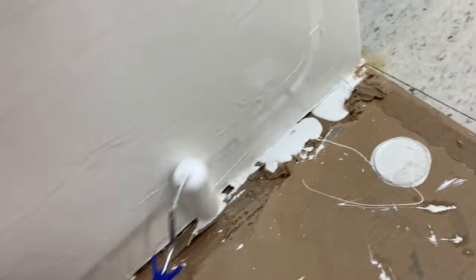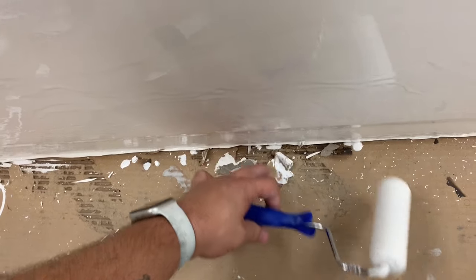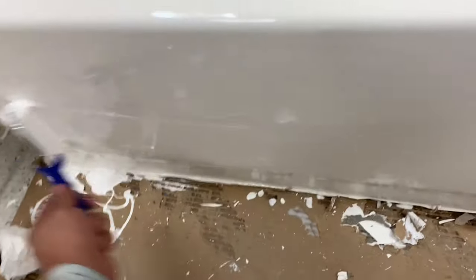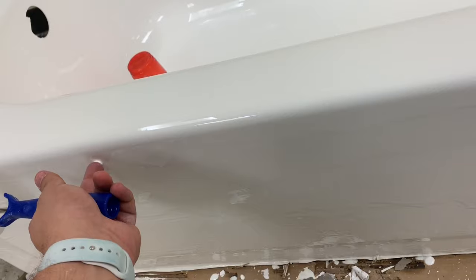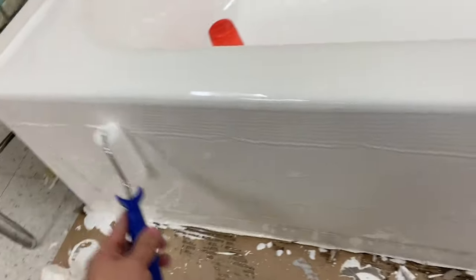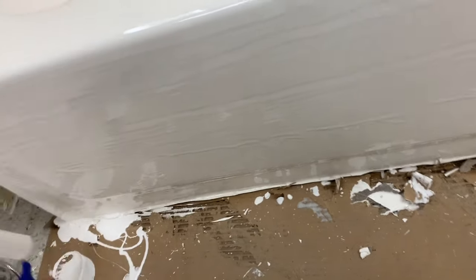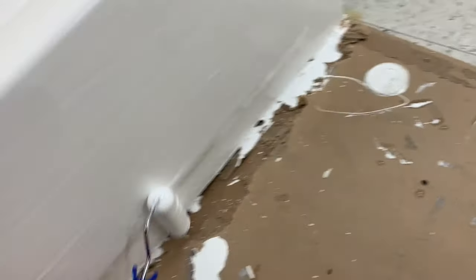We have to be very patient with this and make sure we get everything covered. I've got a couple little pieces of dirt in the finish - just going to stick my finger on there and get that out quick. Now we're going to put one quick, very light pass - just run your roller on there with no pressure at all - just to steer everything in the same direction. We won't touch the outside again. It looks terrible right now, but this will all level itself right out.